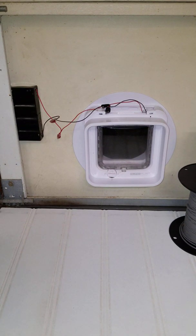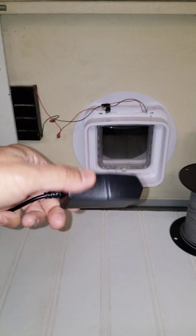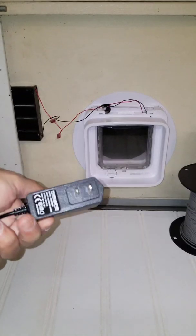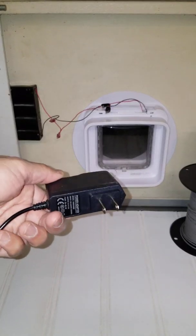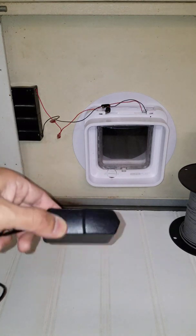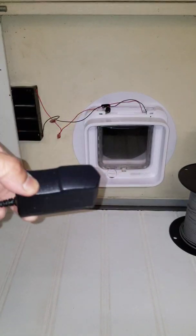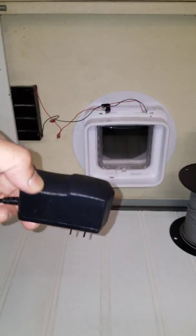In any case, I obtained a couple of inexpensive power supplies — power adapters such as those used for cell phones. This is a three volt output at one amp, and I replaced two of the batteries with one of these and the other two batteries with another one of these, and I ran into the same problem.